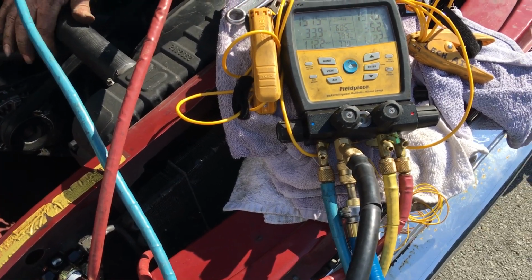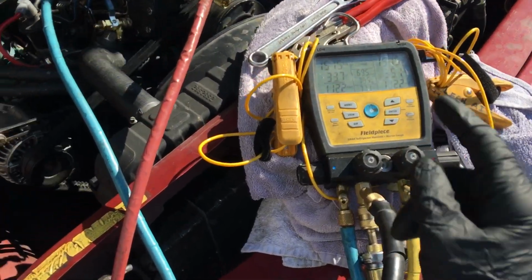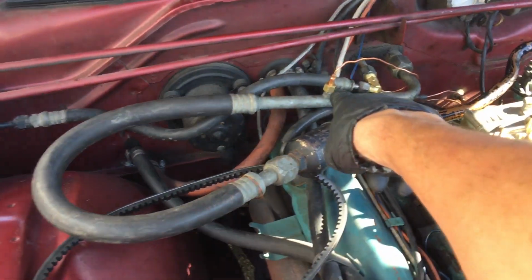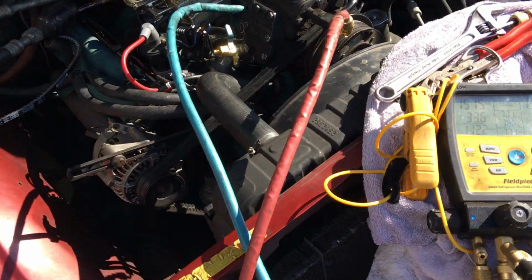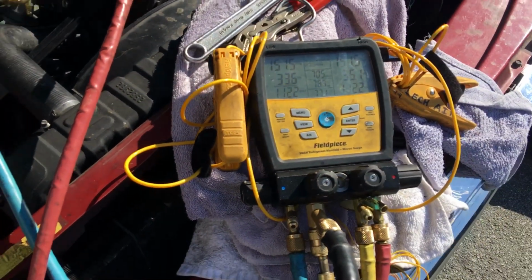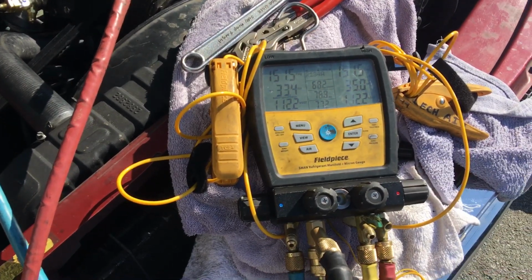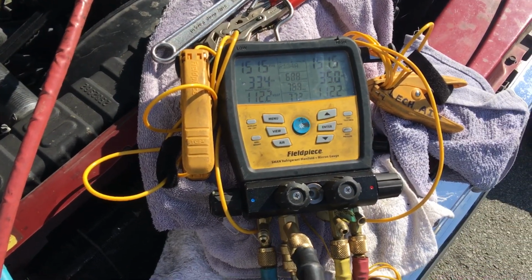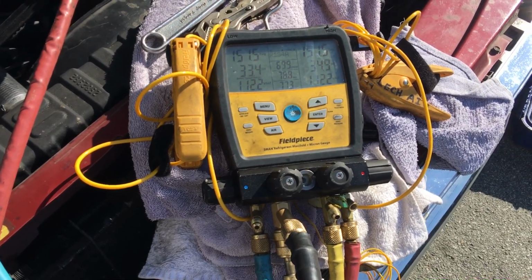And that's about it. It's looking pretty good at 150 psi. We did originally at the very beginning have one leak. He just left that one fitting loose right there. I put a little Nylog on it. He tightened it up. It had an O-ring. It was good to go. All right. So I'm happy with this for this 60 seconds of pressure decay test. That's about it.